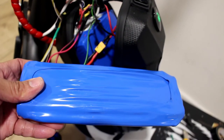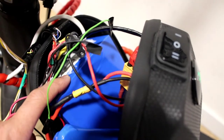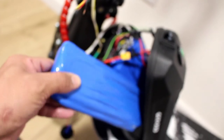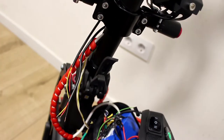Now we're going to connect to the 3S 12-volt battery, because if we connect to the 42-volt battery, the lights might be damaged since these lights are only 12 volts. So we're going to use the 3S battery. Let's go and connect the wire.